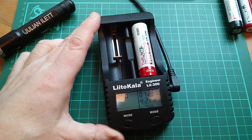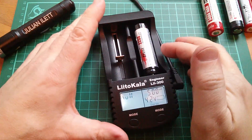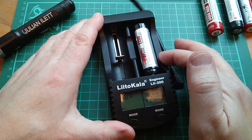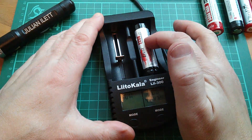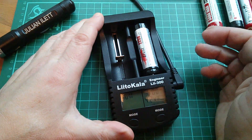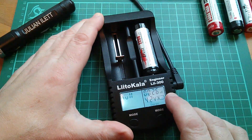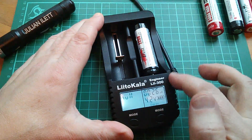But I missed something. This E-Fest cell, which I bought on eBay from a UK seller, was specifically sold as being high current — for vaping equipment, that sort of thing. It's not got a particularly high capacity at 2250mAh, and it's lithium manganese rather than lithium ion. But the milliohms measurement by this device — the internal resistance — is 26 milliohms. So this cell really is giving a low resistance result.